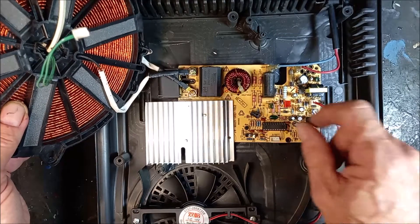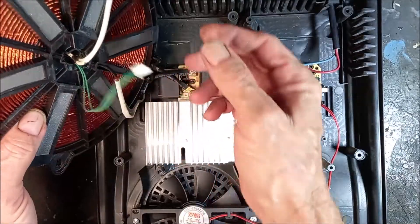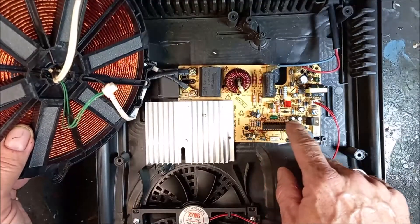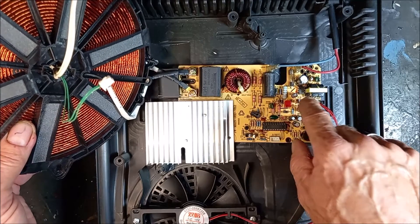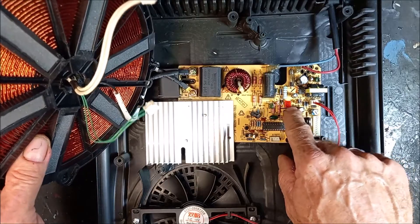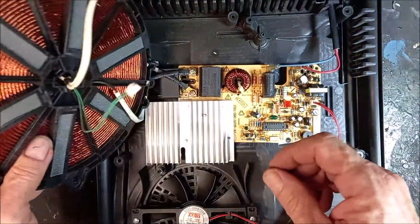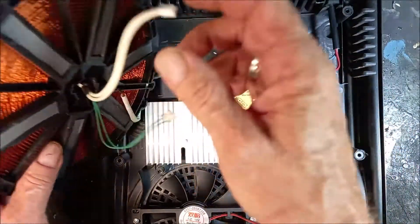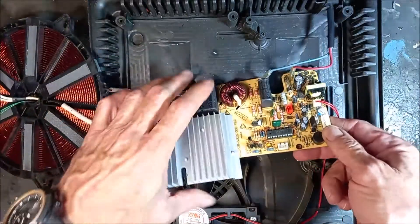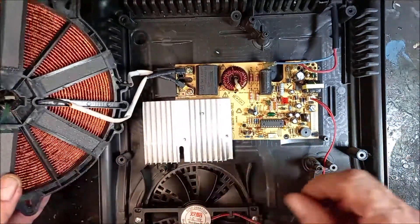Here's a fuse. I checked the fuse — the fuse is all right. In here you can see there are two plugs. One is, I think, the thermocouple feedback — that's what the thermal paste is here for. And the other one is a fuse. I almost thought it was the driver IC that switches the power supply, but there's no output. Then I see here's a fuse — it says T fuse. And I thought maybe the fuse, most electronic appliances for safety have this fuse inside the coil. And then it was open circuit. So what I did, I just shorted out the point here in the bottom, and then it works. So obviously this is a bad design or a bad fuse that caused this whole thing.